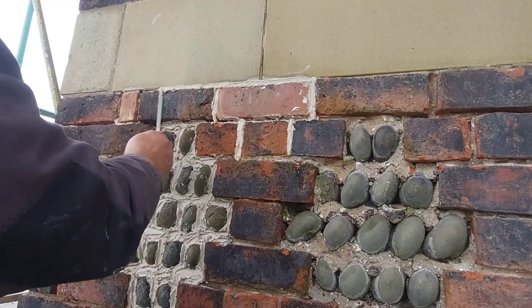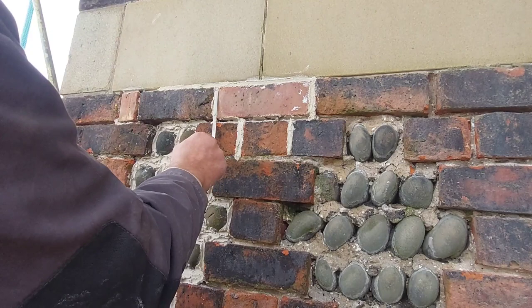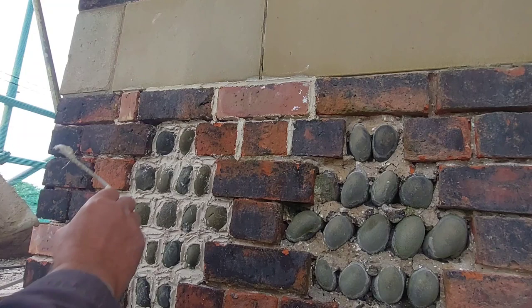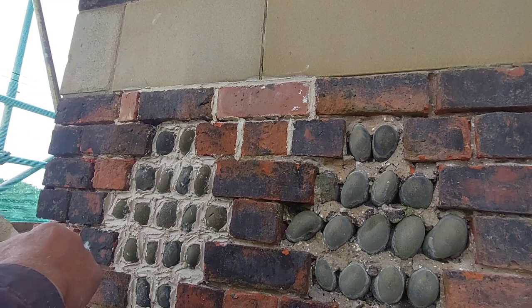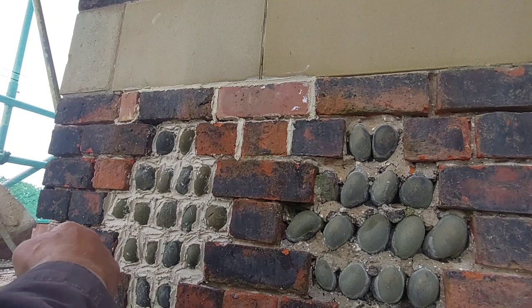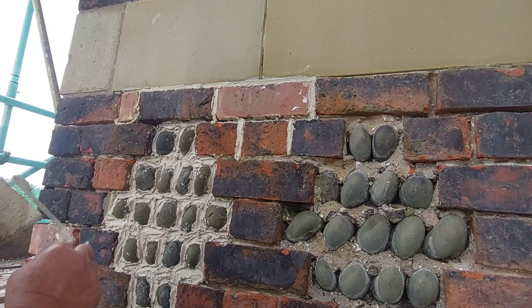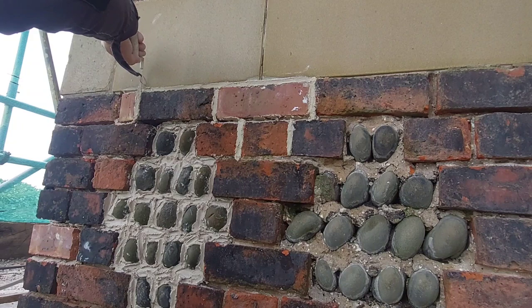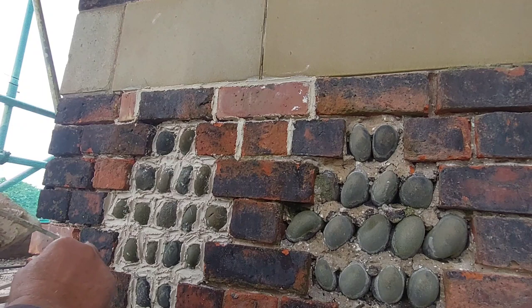Now these bricks are a clay common, 80mm clay common. And when we say common, well, they were very common. And most brick manufacturers were actually making these back then. So the chances are that the back of your house or boundary wall or something like that is actually made out of this particular kind of brick, if it's indeed from this era, from the Victorian era. And under no circumstances should you apply any cement based products to that brickwork, whether it be pointing, rendering or brickwork repair, because if you do, over time you'll end up losing your bricks, and that's not a good thing.